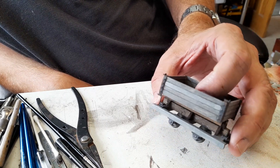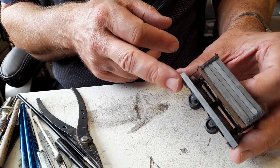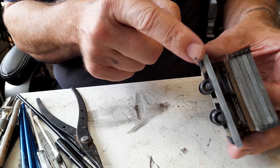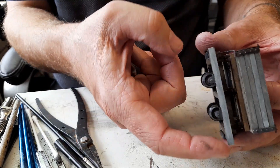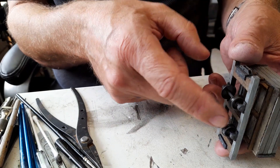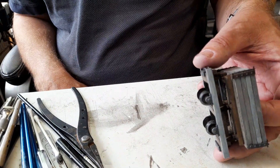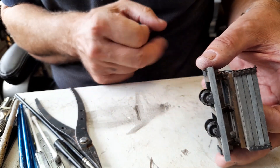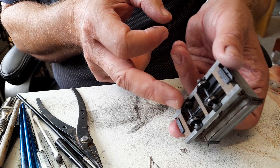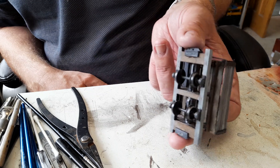It might get a bit more finishing, we'll see. But this is it — we've got a laser-cut chassis. This is two layers of 2mm MDF laser-cut to form the beams and cross beams, and then laser-cut axle boxes which just plug in. Needle-point bearings which again just plug straight in, and that gives the right spacing and works very well.